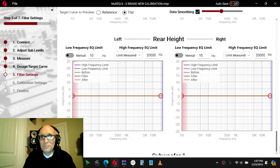I did a calibration last week and I did the alignment point at 50 Hertz. And I'm like, I think I could get a bit more juice out of this by 40. And I think I have. This part I'm not so bothered with, right? The performance here versus the performance here. Yeah, sure, we only gain about 0.3, 0.4 of a dB, but in the maximum area, I think that's more valuable than gaining half a dB here at 80 Hertz. That's what I do. So, yeah.